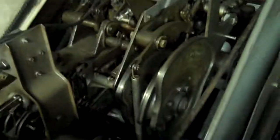It's a little dark over this gearbox, but that's your 4-to-1 assembly right in there. That crank arm — you can't really see it, the sweep links are in the way — is bolted to the main shaft that comes out of the 4-to-1. You can see the position it's in now as the machine's at zero. Basically, the 4-to-1 turns 4 complete turns every cycle, the 2-to-1 turns twice, and the 1-to-1 turns once.